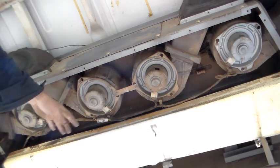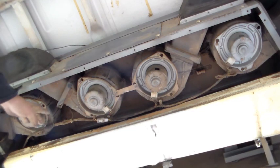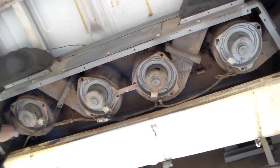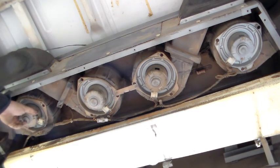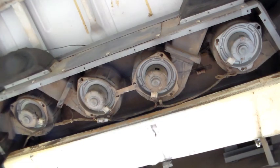Since I don't need the right side, I'm going to disconnect those two blowers, unplug and remove them, and remove the ducting that goes from this box to the right side. Then I'm going to modify this box — bend it down and along at this point — so it gives me a little bit more headspace above where the bed will be. I don't see any reason why that won't work, so that's my next move and I'll bring you back when we've made more progress.